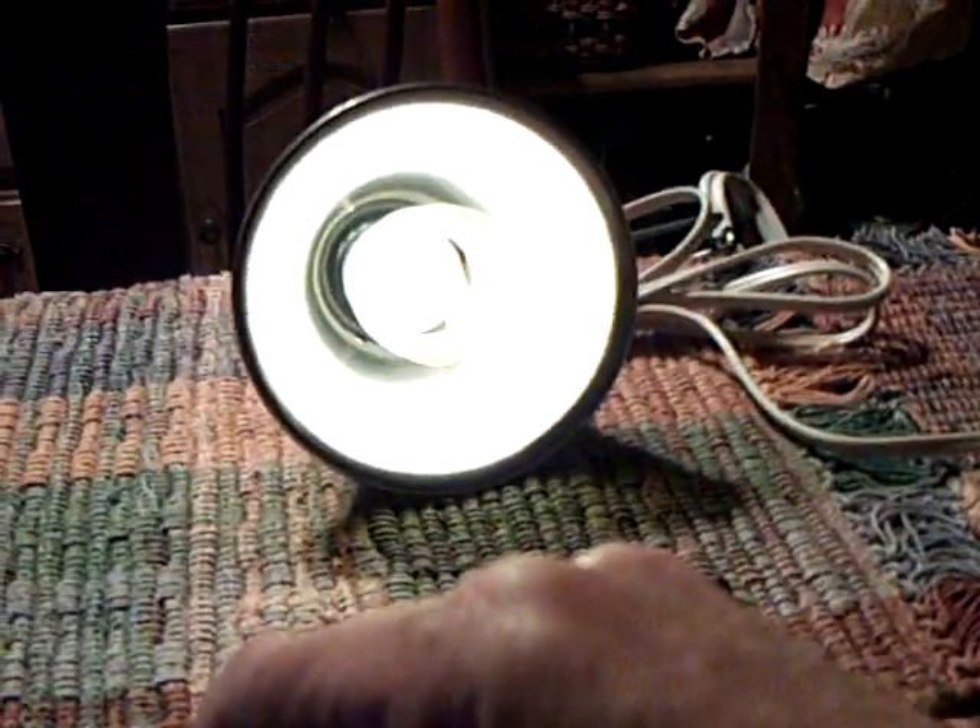The CFL just popped on. I'm at about 32 volts. I'm going to let this go on up to about 33. There's a reason for it — when this cap builds up to a high enough voltage, the CFL will stay on at a lower amp draw.